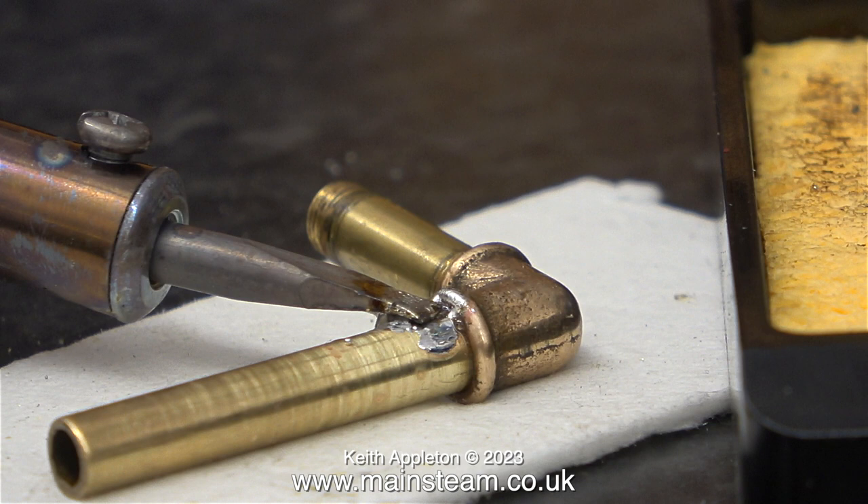The procedure is very similar to any other kind of soldering. First of all, you tin the bit — that gives you conductivity of the heat from the tip through to the work. But it still takes quite a while for the work to reach the right temperature. I touched the bit onto the metal parts and applied quite a lot of multicore solder.